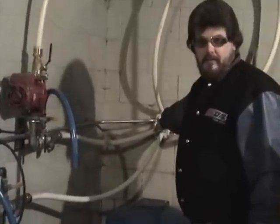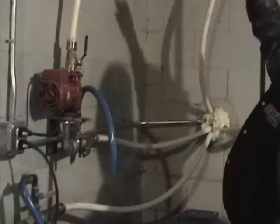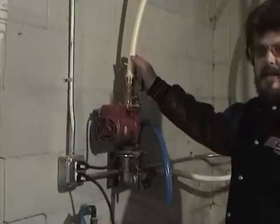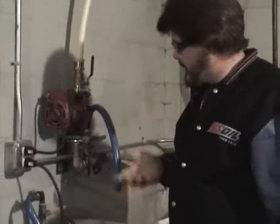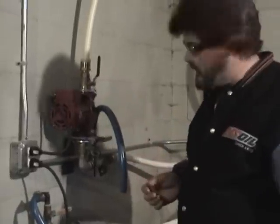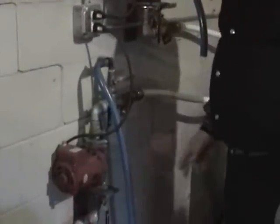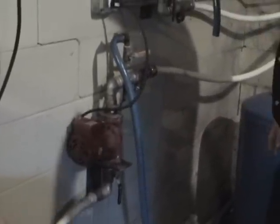This is the incoming water of the wood burner — the wood burner is 33 feet outside on the back wall. You've got two lines coming in to the pumps and two lines leaving. The first line comes in, the pump grabs onto it and sends it over to the water heater; this is going to send it out to my shop. I have my pumps in the house and not out by the wood burner because I'd rather work on them in the basement. This is where I take my water sample to check the pH — I shoot to keep it at seven. This over here is my fill: I connect it to the faucet and can fill water into the wood burner through these lines.